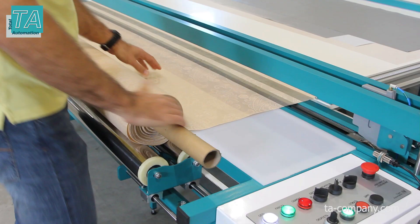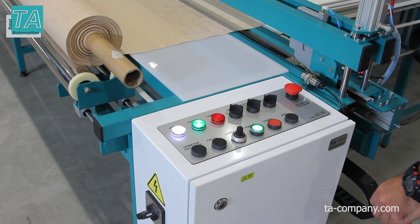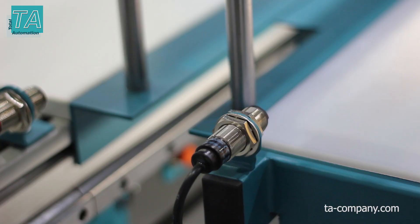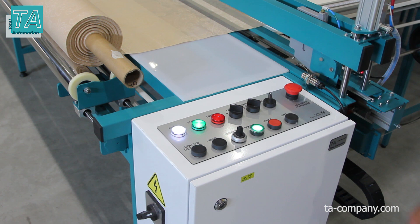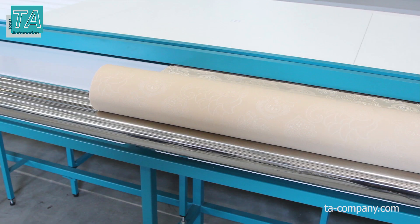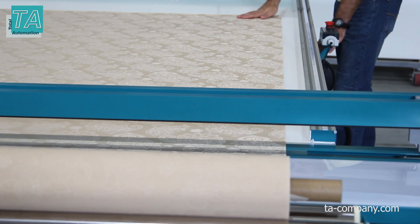The table includes unwinding shafts, a backlight section for checking the fabric, a double-sided pneumatic clamp, and an optical safety barrier that stops the clamping bar when hands or any interfering object are underneath it. Additional features include automatic change of tool — ultrasonic or disc knife — adjustment of the knife speed, and a fabric control sensor, which reduces cycle time when cutting short fabrics.